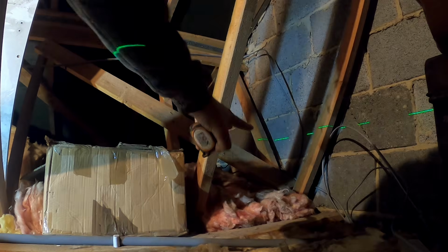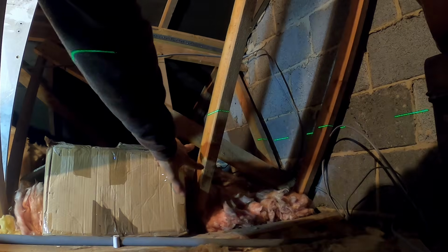And obviously we always need to be thinking about air as well in bungalows. So ideally we want one central high point. I might just be able to keep all these level so it would bleed out at the boiler, and then basically we're dropping back down to the radiators, if that makes sense. I'm not going to have any issues with air lock-in. We'll space them at 100mm so we can get these lagged as well.